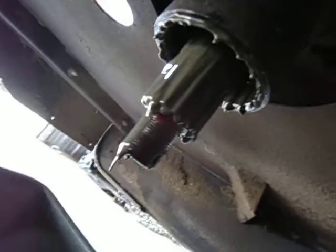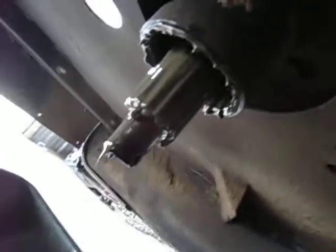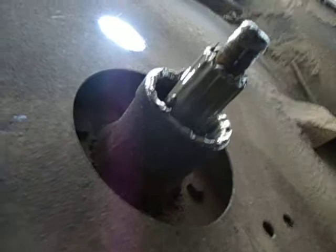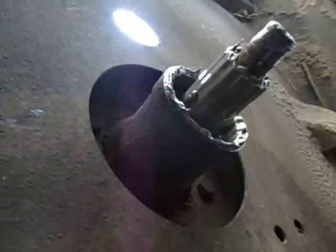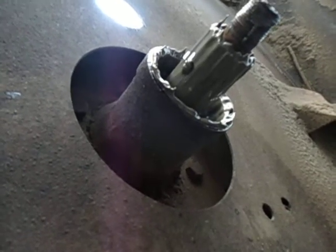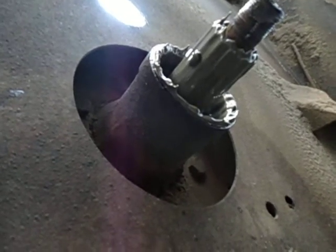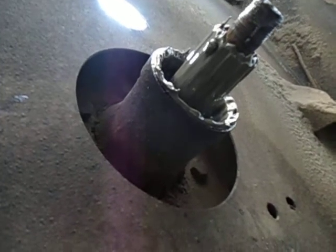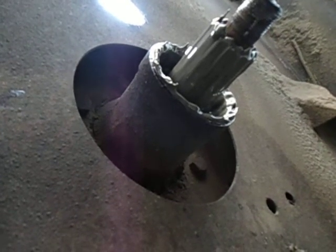It's hard to see with all the grease on everything, but Bushhog did tell me the truth. I compared the splines on this shaft with the splines on this shaft — they're in the same condition. So the stump jumper splines are sacrificial; they'll get chewed up before it chews up the splines on the output shaft on the gearbox. That's a good thing.